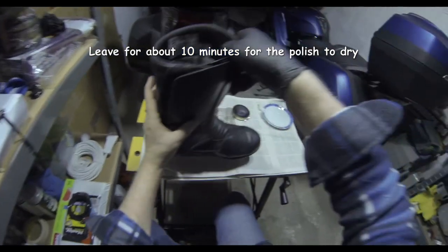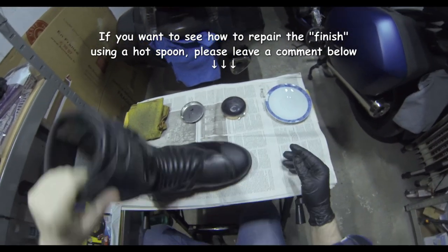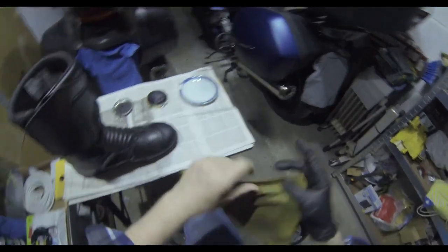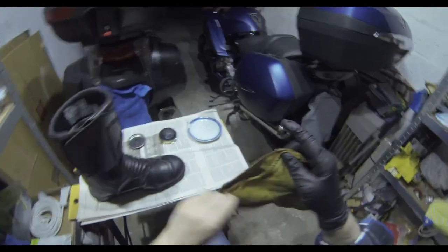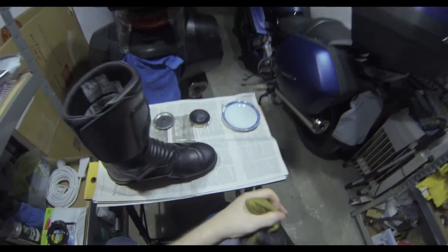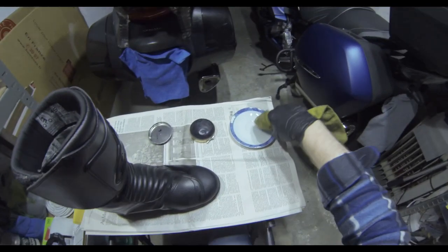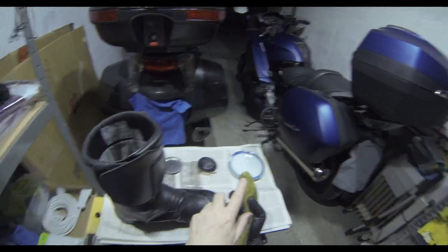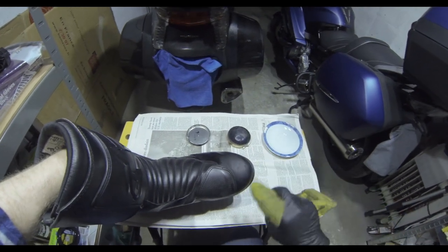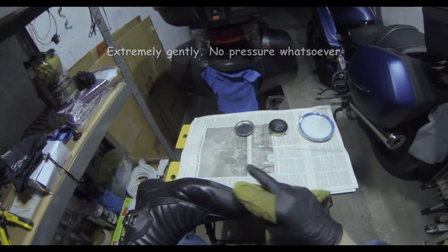We've got about six or so coats of polish on. I can just see a little bit of the damage but I'm not going to repair that today — that's going to need the hot spoon treatment. This is where the dilute isopropyl alcohol 7% solution comes in. Get your cloth and wrap it around your finger. Hold it tight — you want a nice edge just there. Tap it — it's hardly damp, and you don't want a lot. This is important. Just put a couple of dabs and then very gently start to rub.